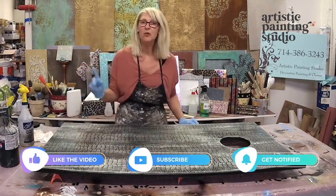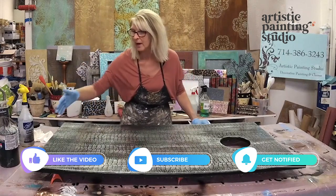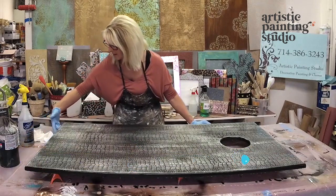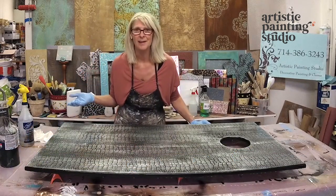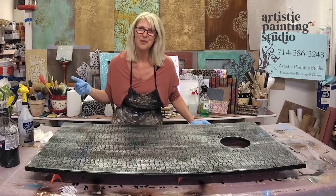The other thing I will be doing is I'm going to be setting a timer for about an hour from now so that I can come around the edges and pick up any of those drips so that I don't have to do a lot of sanding later. And we'll be back, okay, to show you guys the finished product on this.